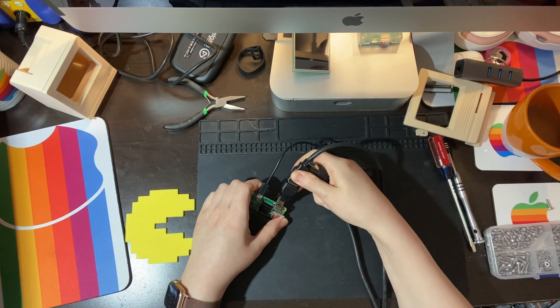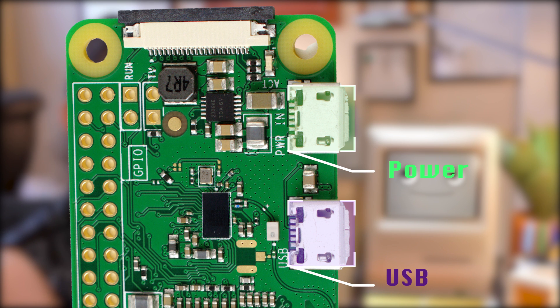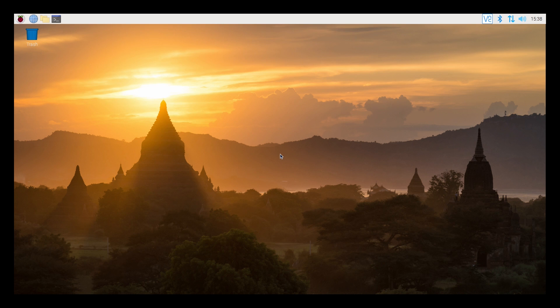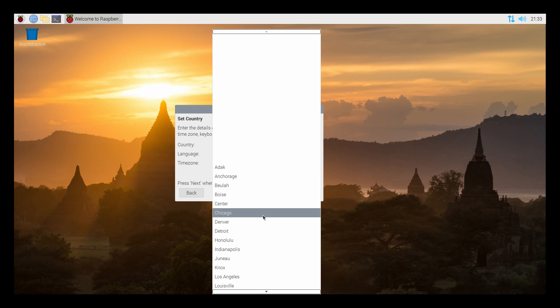You'll need to connect a keyboard, a mouse, and a mini HDMI cable for this initial setup. Connect your Raspberry Pi Zero to a micro USB power source. Be sure to use the port closest to the ribbon cable edge, because this one is power and this one is for USB. Once everything boots, let's do a little housekeeping to keep our Raspberry Pi secure — you'll want to change the default administrator password and enable SSH.